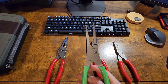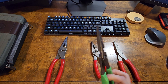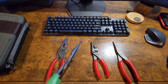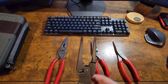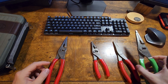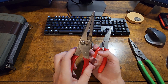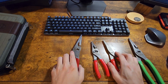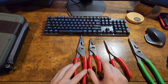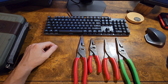Overall, I'd be happy to buy another pair. I might even buy one more full-size pair for a different bag. I've been super happy with them. The adjustable feature is pretty handy for some stuff - three-quarter inch and half-inch lock rings inside of electrical boxes, holding strangely-shaped objects while you're drilling into them, a bunch of random things. It's just an additional feature in more or less the same footprint. They're a little wider than your average needle nose, but they feel solid, rugged, and reliable, which is what's important to me in a tool I carry and use every single day. Hopefully you enjoyed this video - feel free to drop a comment, I'd be happy to reply, and thanks for watching.